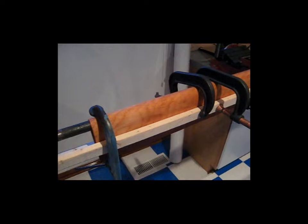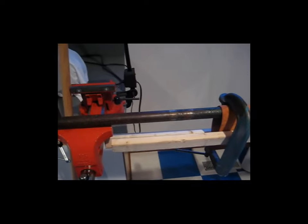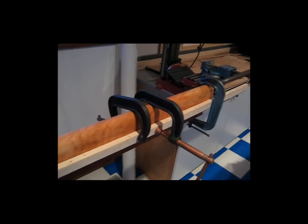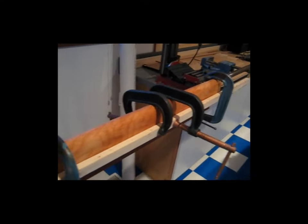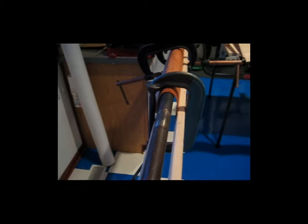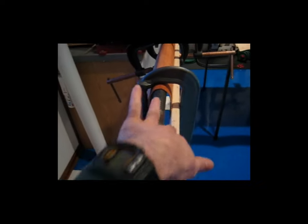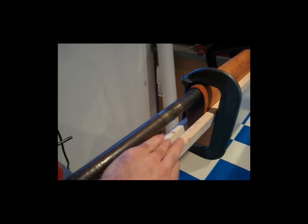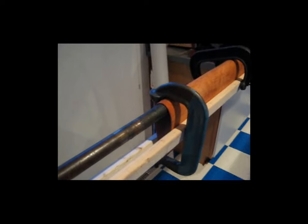This is one of my leading edge pieces over the steel pipe to start to bend the general shape so that it will epoxy easier to the ribs. And this is fresh out of my fancy-dancy soaking apparatus, also known as a bathtub. What I did was, this is just a steel bar from one of my dad's old-school free weights. And these pieces of wood here, if you guys have bought any of your plywood from Aircraft Spruce, these are the boards that they ship with their plywood to help hold shape. So I keep them and I use them for various things.